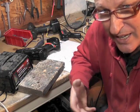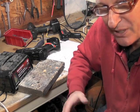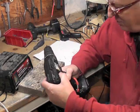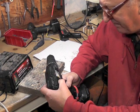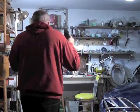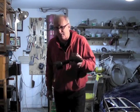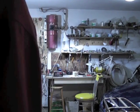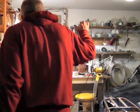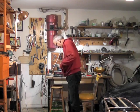If you have 12 volt and only two and a half amps, it's not going to go anywhere - your drill is going to have no power at all. You have to have 12 volt, but I'd be very careful not to go over six, seven, or eight amps. Nothing is mentioned on this drill about maximum amperage. You want your wires to be around 15 feet - I've got 17 feet on that one, and look how far from my bench I can go. I'd say 12 to 15 feet maximum on the charger, just so you don't draw too much amperage and create too much heat.